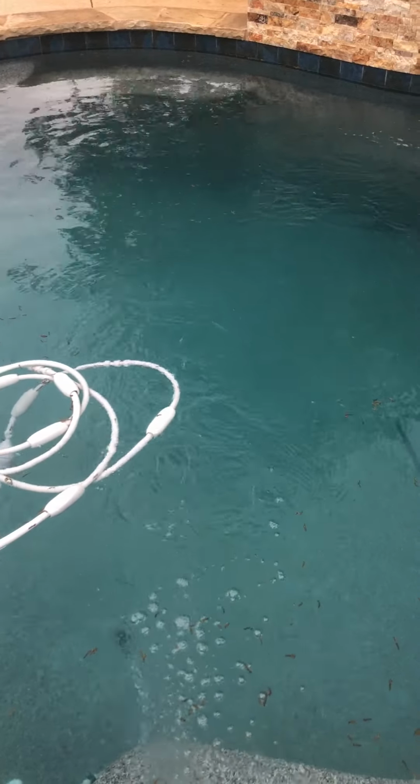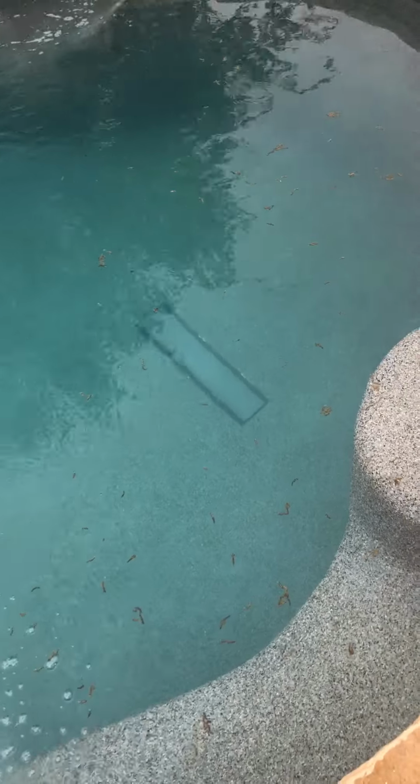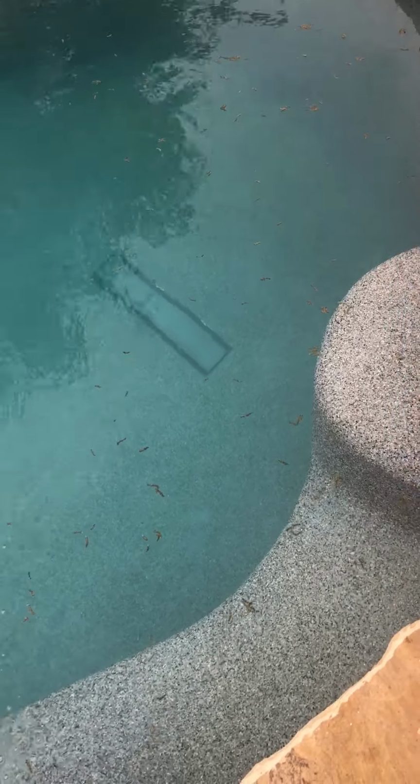We got you okay in the starting position with this one down here. You're right in the middle of the two of those. Okay. So we're good. The alkalinity is good. Your eyes should not be having problems with it. That's about, I'd say, 100 to 120, the alkalinity. Yep. The chlorine should be down to about a 3, that color right there, I'd say within 2 hours, if it rains even quicker. And that one is going to be about a 7.6, because it's already getting darker. A little bit is in between those two right there.